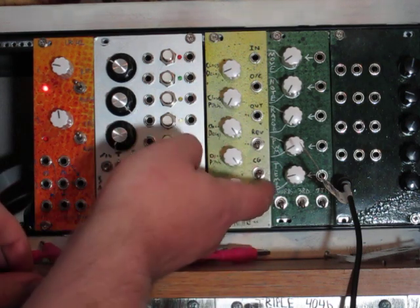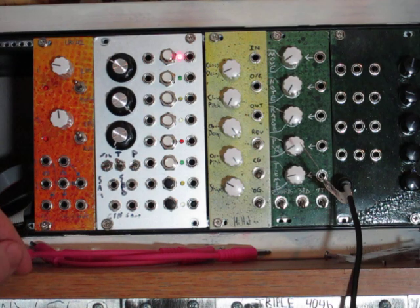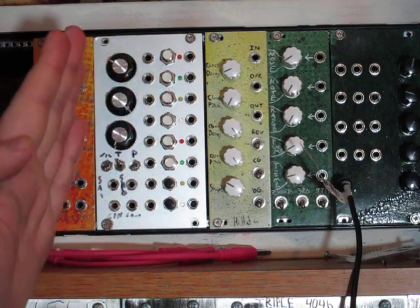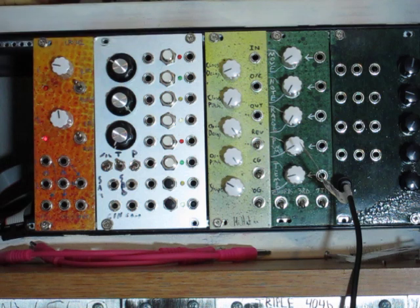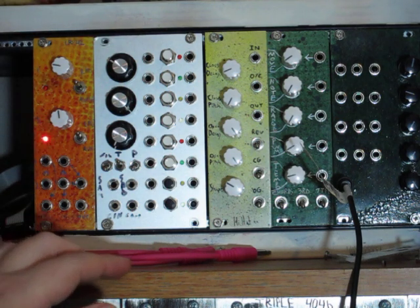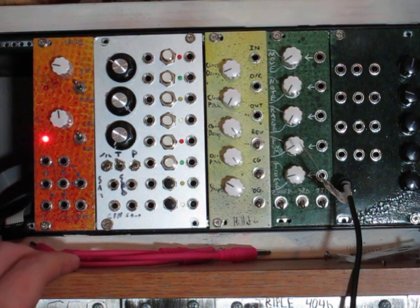On the toggles we have the gate toggle. What that does is instead of starting to decay on the rising edge of your gate, it'll start to decay on the falling edge and remain high — that way it makes it sensitive to the width of the input pulse that's triggering it.